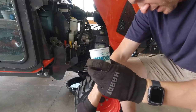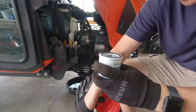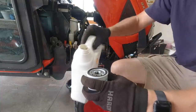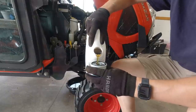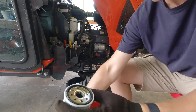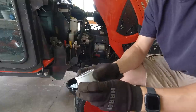What I do is I prime my oil filter, which means I just put a little bit of oil inside the filter, because that filter actually holds maybe half a pint of oil or so. For the tractor to start and have no oil in the filter is hard on the tractor, so I don't fill it all the way up, but I let that oil soak in there.